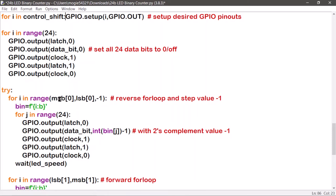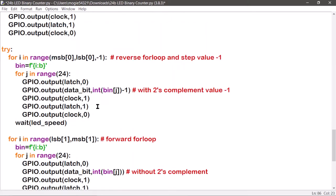But what is this? This is the big number, and this is also the least of the big number. And then down here is where we get our second for loop. Down here we have this for loop within the for loop. I forgot to mention that it turns all the actual magic ones and zeros on or off with the variable J. The variable J right here. So this is actually incrementing the numbers, and every time this increments on the outside, this loop gets done. This increments again, this loop gets done again, because it's nested.